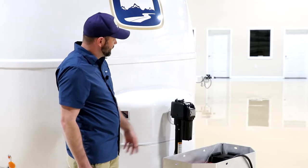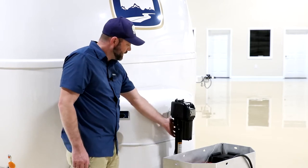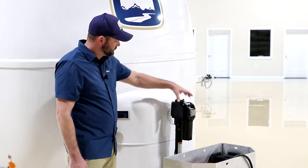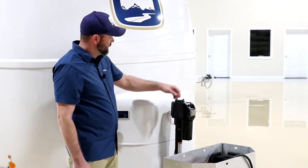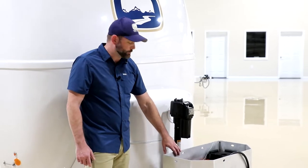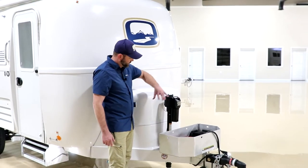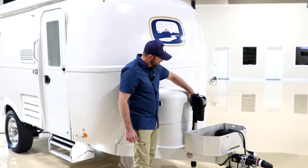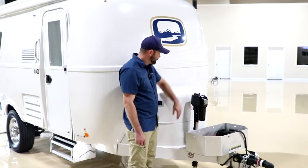On the jack, the head can be turned. You have three set screws at the base of the head as it goes onto the post — you can loosen that and turn your jack head any direction you choose. You may want to turn it one direction or the other as it slightly impedes the storage basket option. However, you may not want to turn it to the driver side as we have a deck port there — turning it to that location covers up the deck port.